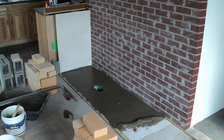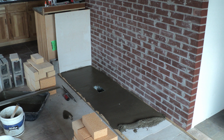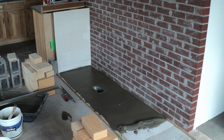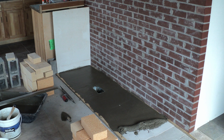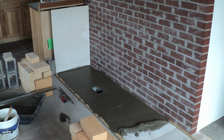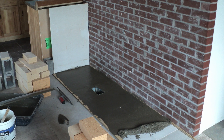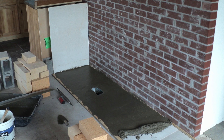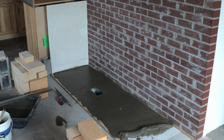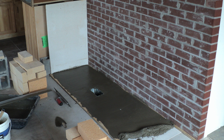Back up on top I built a brick wall for the back of the fireplace. The bathroom would be on the other side. On the one end is a cabinet so I've built a six inch block wall there and left it hollow and put a one inch thick ceramic fiber board to insulate it. I didn't want heat going in that direction. On top of the concrete slab where the core of the fireplace would go, I poured a one inch thick slab of refractory cement for the bottom of the fireplace. I separated from the concrete with a layer of ceramic fiber paper — I wanted to allow for heat expansion.